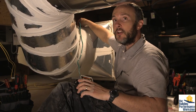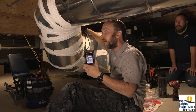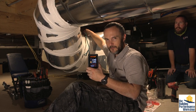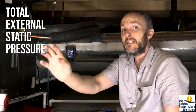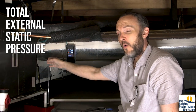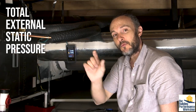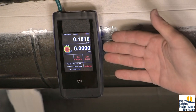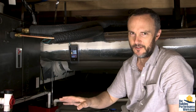This elbow — this 16-inch round duct with two turns — is adding another 0.1, another tenth of an inch of water column just from this length of duct. From that hole to this hole we've built up pressure considerably, but not a bad thing as long as you've designed for it. We make a big deal about the blood pressure of the system not being too high, just like a person's blood pressure. Right before we hit this piece of equipment we had 0.3 inches of water column. For most systems to pass this black-and-white pass-fail test you need no more than 0.2, which would add to the 0.3 to make 0.5 — half an inch of water column. We're getting just shy of 0.2, so this system would pass a normal system check. This system is configured to deal with up to 0.8, so being really low is great — you want to pass with flying colors, and this one does.